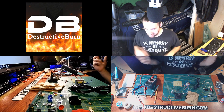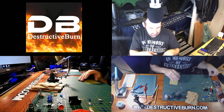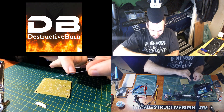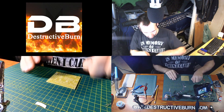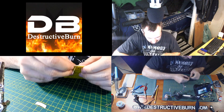I'm going to install the diodes first. There's a little white line on the board that will tell me the direction — I just have to stick them in there and solder them in place. I'll try to make them look pretty.